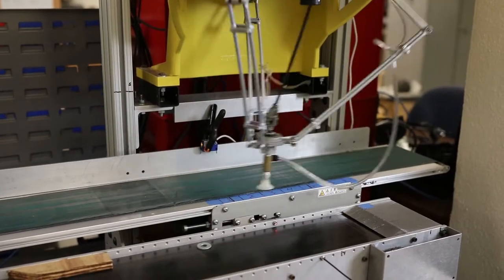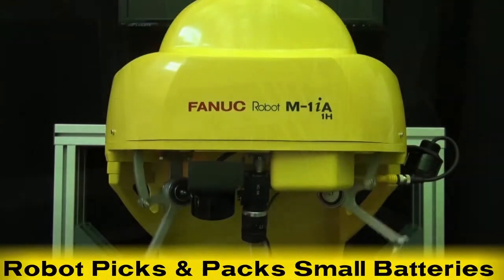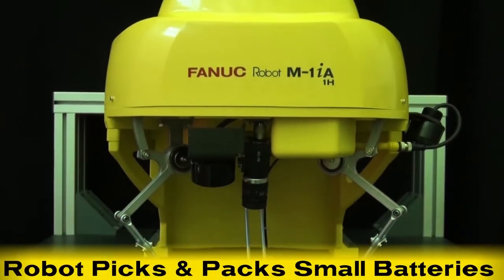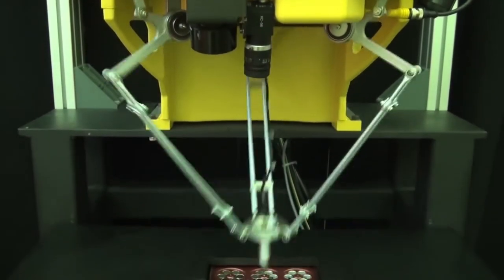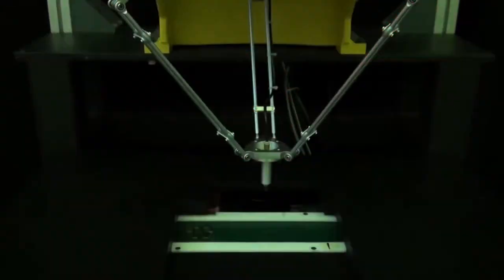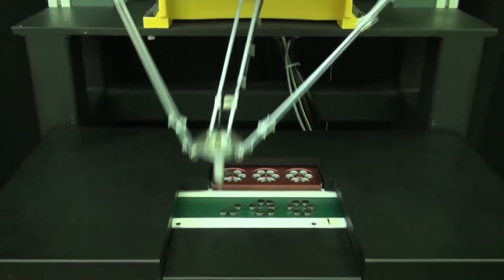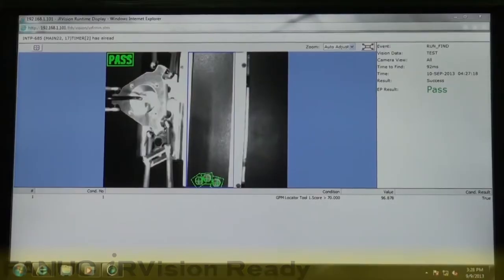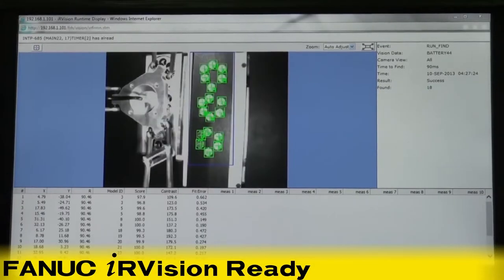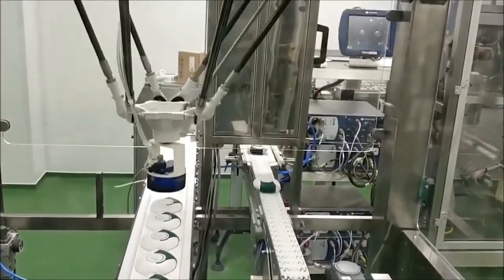This is our M1IA Delta robot by FANUC. Used for high-speed, lightweight parts handling, the Delta robot, which is sometimes called a parallel robot, can have joint speeds as high as 3,000 degrees per second, as compared to joint speeds that range between 380 and 1,000 degrees per second for something like the LR Mate. When coupled with machine vision, which is the red light you see in the video, Delta robots are able to achieve an extremely high rate of throughput, but at the price of not being able to move heavier loads. For example, our robot can only move a half a kilogram payload, and the maximum supported payload by ABB's largest parallel robot is only 8 kilograms.